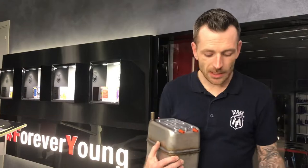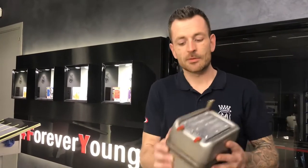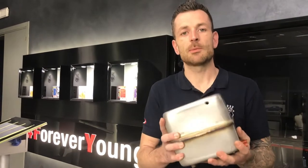For the construction of this apparatus, we took the liberty of creating a machine with durable materials so we can work long and ensure the machine performs at its best for long periods of time. A special feature is that we created a boiler system that's not conventional copper, but instead uses inox induction material, so there's no lime scaling. Also, because of the stainless steel material, it can hold up to 160 bars more easily than copper, which needs more density to create enough pressure to withhold 160 bars.